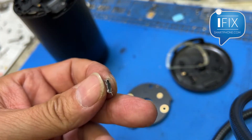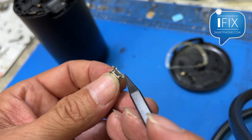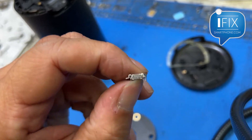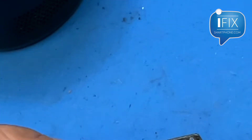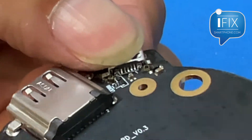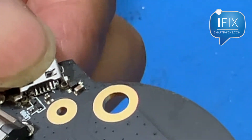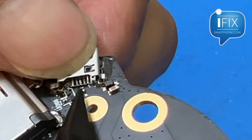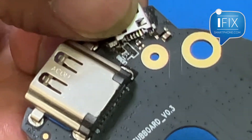What I did was bend the pins down a little bit. There are five pins — let me zoom in on that. Those five pins are bent downwards to make contact to the pads. You can see it's actually touching, so I should be able to solder this onto that. It's going to have enough room to make good contact. I might cut just slightly to make good contact, but this should work.